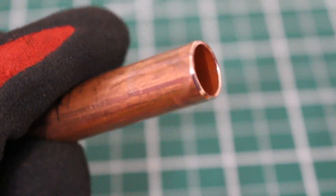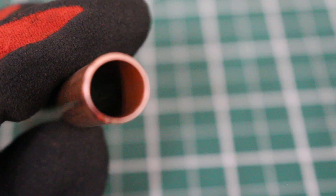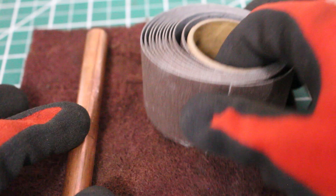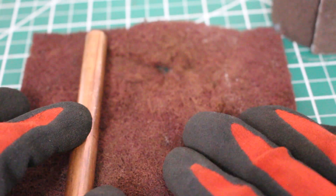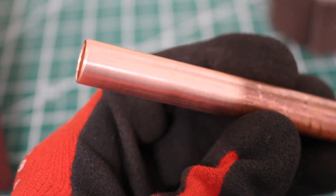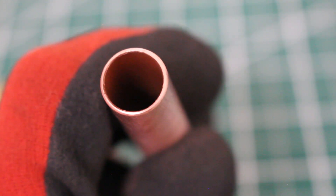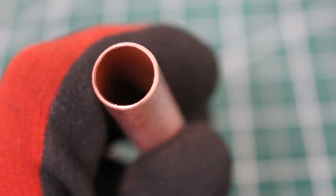We now have a nice, clean surface on the outside and the inside. Next, they want you to sand down the piping — they don't want any lines or streaks, so instead of rough sandpaper, I'm going with the scotch pad. Now that is a beautiful thing. From here, inspect your piping and make sure it has no defects. Then mark your fitting — they do have a special tool for that, but we're just going to freehand it as this is a demonstration — and we're ready to push to connect.